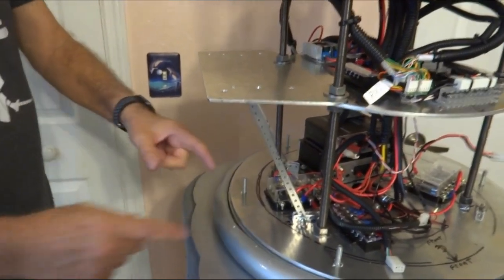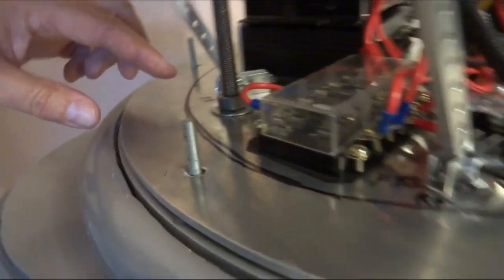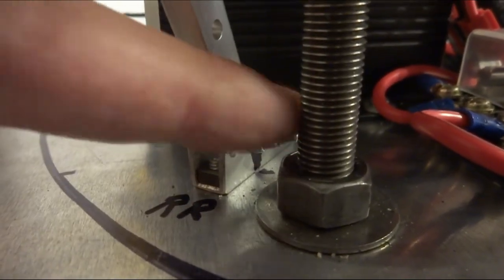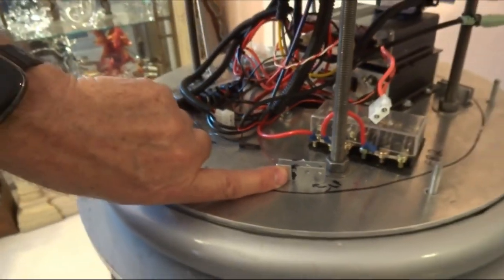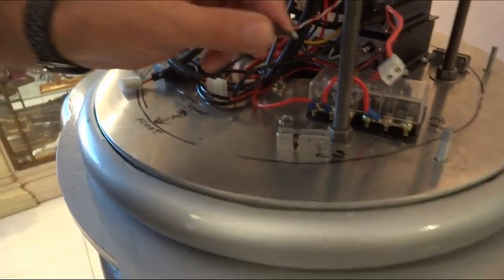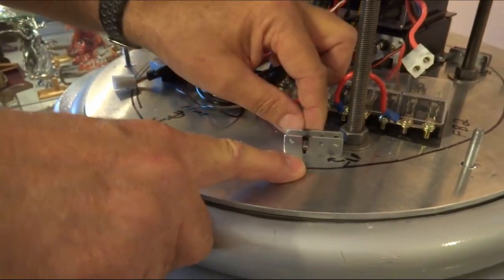There's one more thing I have to mention. All the bolts — these little shoulder bolts — they're all the same size except for two. There's one in the rear back here on the right side that's shorter, just because it bumps into this stanchion here. That gets a short one. And the second one will be up in the front in this position — again, you can see the little mark that I have here. This is a much shorter bolt that will go through here just for clearance of the torso coming down.